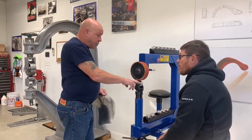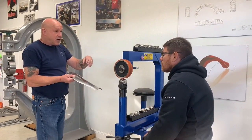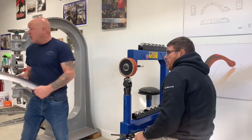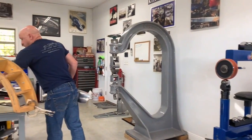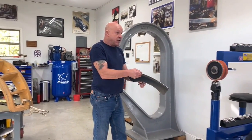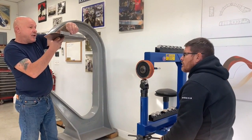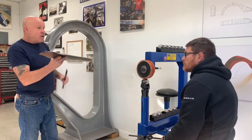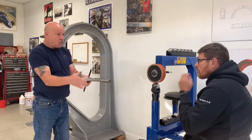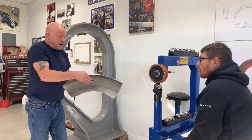You can do, but we're going to be taking the rubberized wheel off, because you've got to put more shape into it. So instead of linear forming, no, you need to linear stretch. Okay. Because right now we're getting to a point where you formed it as much as the panel will take before it starts becoming hollow. You see how it's hollow now? Dressing up. So now because you've changed the shape from being relatively flat to contoured this way over, it's now starting to come like this.